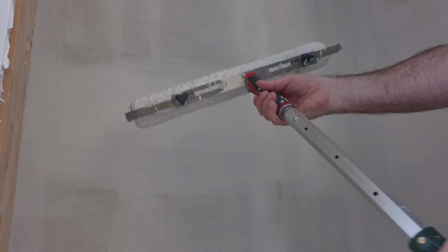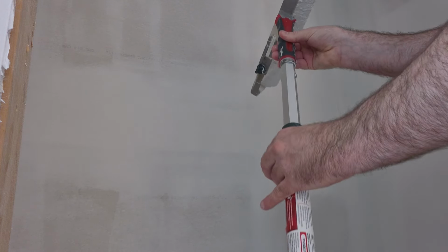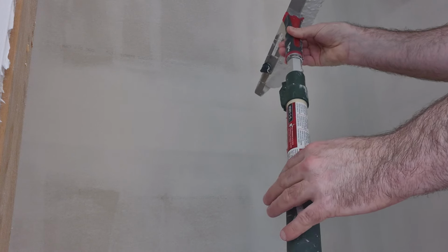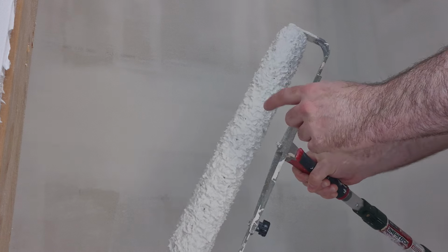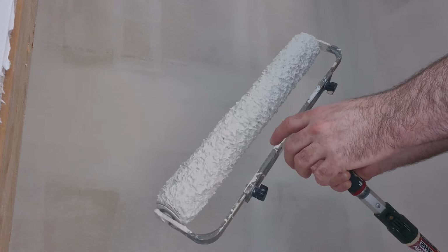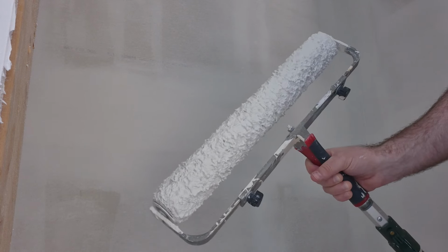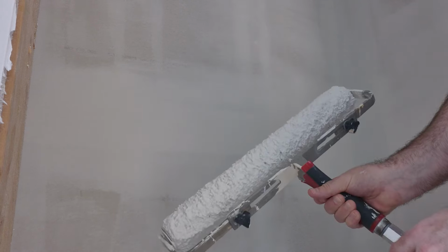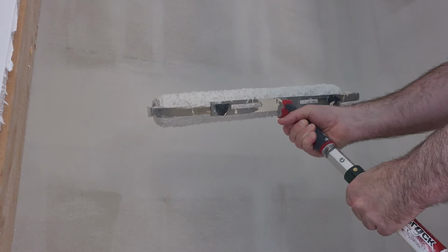2.5 inch brush, did the cutting around in the corners, and now I'm gonna use, I like this paint pole because it's adjustable and you can get it fairly short, so it's good for inside a closet. I'm using a 3/8 nap roller sleeve. I find that they load up really well with a lot of primer or paint, and you can get a big surface covered, especially with the 18-inch.